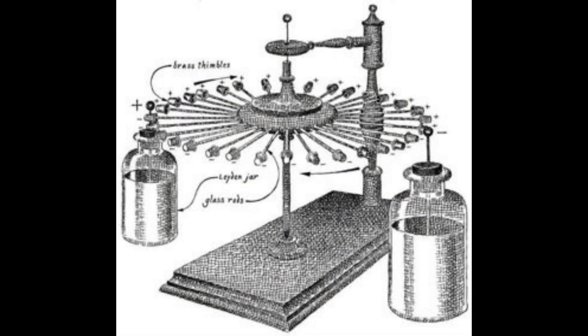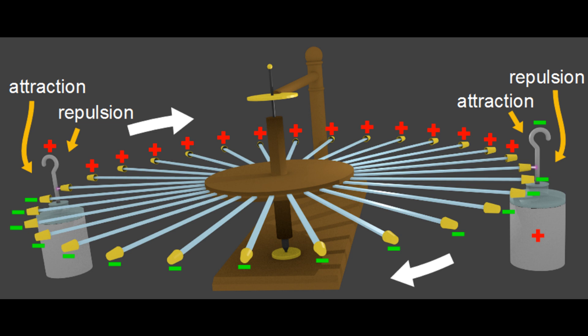Now they need next to nothing in terms of amps — you're talking about micro amps to pico amps. What they really need is a stunningly high voltage. Arguably, one of the earliest electrostatic motors was the Benjamin Franklin wheel, which was basically a bunch of thimbles on a wheel. It worked because electric charges are just like magnets: like charges will repel and unlike charges will attract. If you have a high voltage negative and a high voltage positive, they'll attract each other. And all electrostatic motors work in this way.